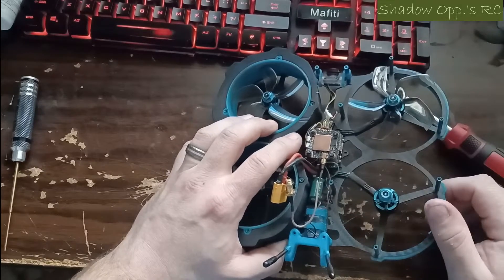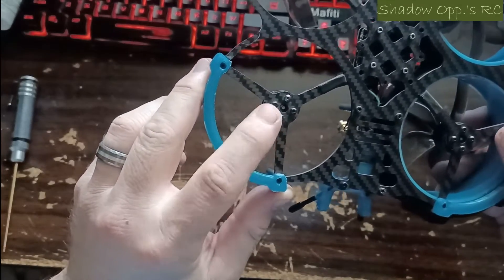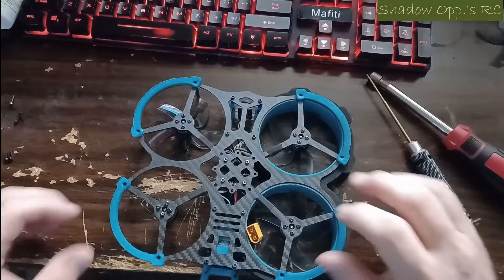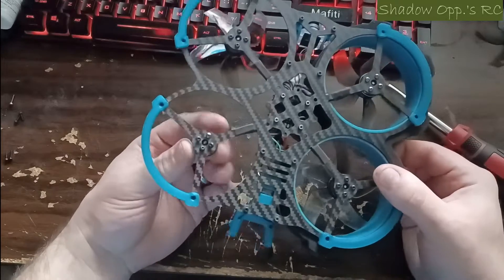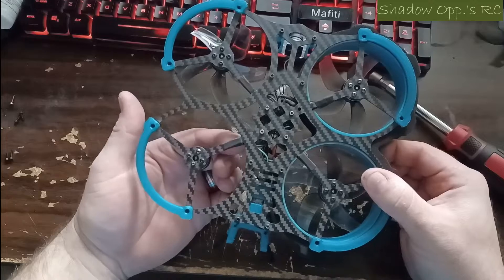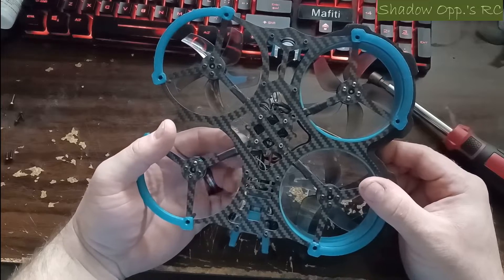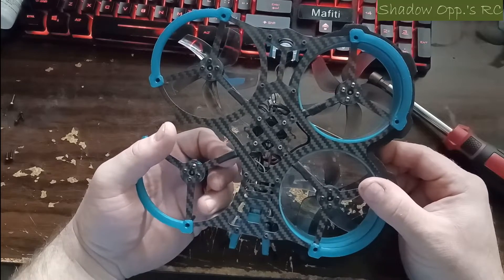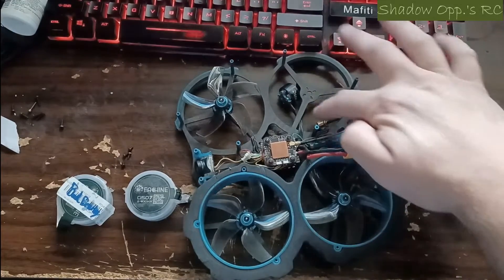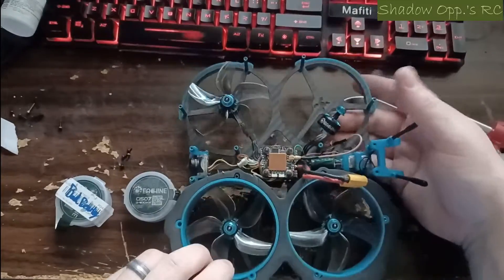There are just four bolts on the back — I'll get those off and we'll be back. Okay, we got the bolts off. While they're loose, we've got to cut this tape. We also have to cut the wires. The pads are really tight on the ESC, so it's just easier to splice the new motor in, which is what I'm going to do. We got the tape off — you can see the motor dangling now. We'll cut that and splice it in a minute.